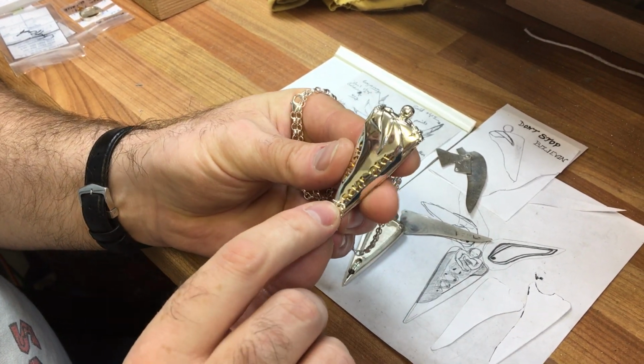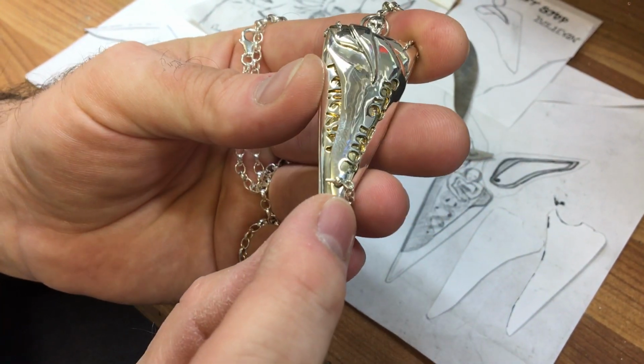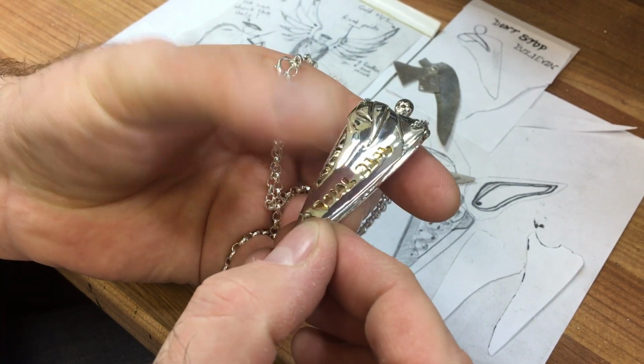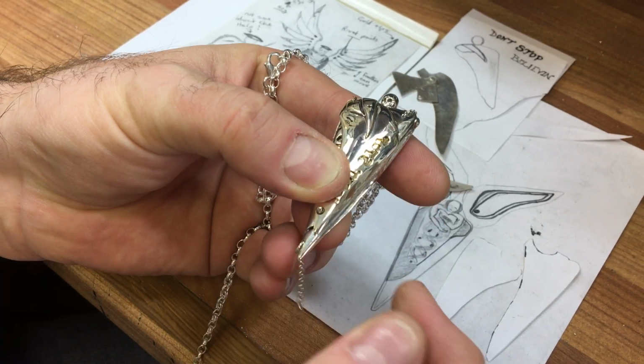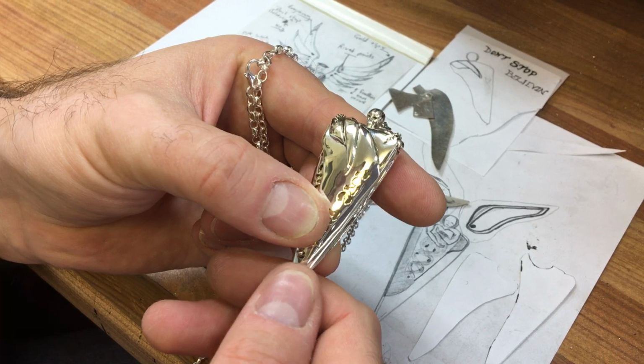So you've got a pin here. I don't know whether it focuses. Can you get focus on that? There you go, you can make it out. So you pull the pin and make sure you push down on there, and that'll make the pin come out easily because the springiness of the metal sort of holds that pin in.